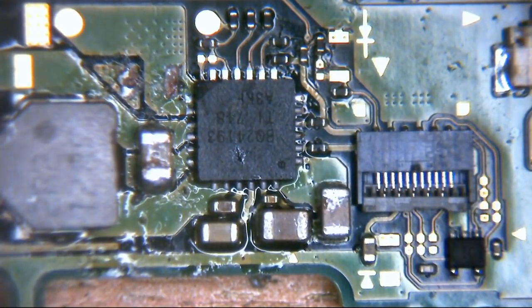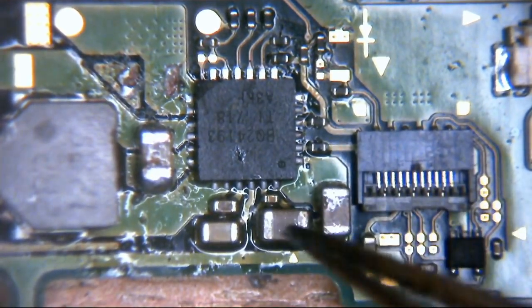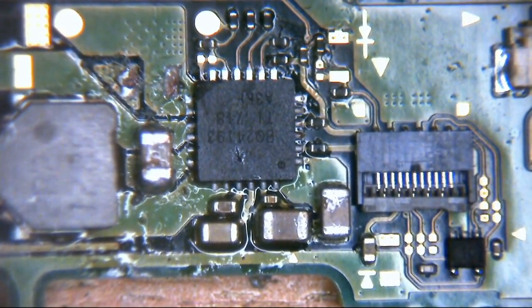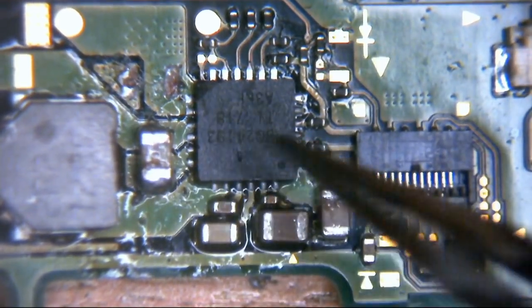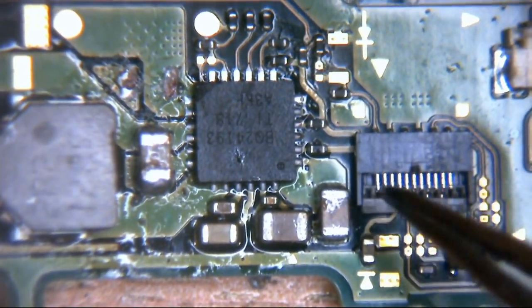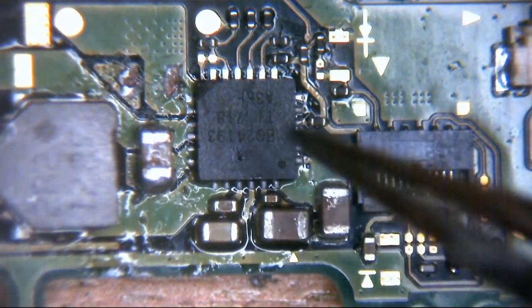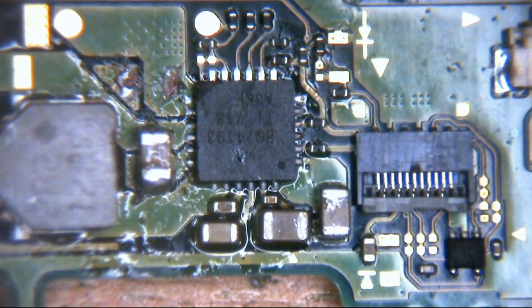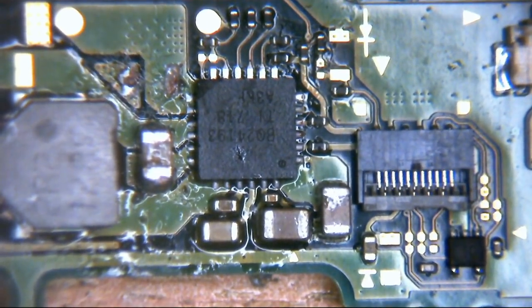This is like sending it around an army obstacle course and it's spotting a gap in the fence and going, I don't have to go all the way over that nasty obstacle course. There's a gap in the fence here. There's nobody watching. I can just sneak through that gap and go straight to the finish line. And that's essentially what happens. When you've got a short on that circuit, rather than it having to go through all the obstacles, jumping through all the transistors and the diodes and the resistors to get to the end of the obstacle course where we eventually let it go to ground when it's done what we want it to do, it goes, no, bugger off, I'm not doing that. I'm just going to go to ground because I can. Now, that's a problem because that means our circuit isn't completed, and consequently, things don't work properly.